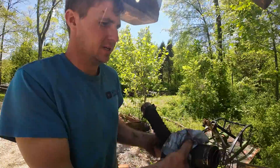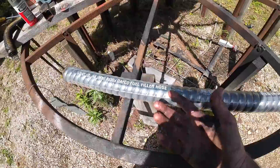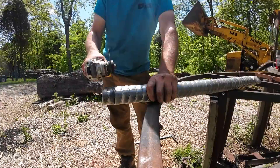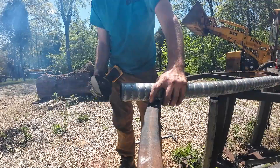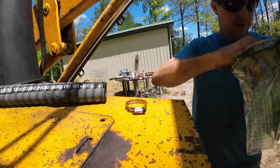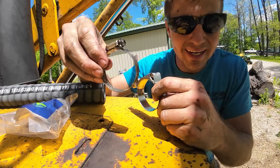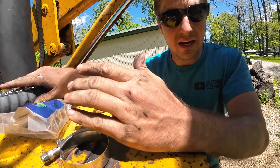These springs are on the inside of suction hoses — they keep them from collapsing. So what we ended up with is actually fuel filler hose, which will stand up to the hydraulic oil fine just like it would diesel or gasoline. It's got the spiral wire inside and the inside is smooth and is the correct diameter. For the clamps, instead of going with a regular style hose clamp, I went with T-bar style clamps — they hold a little bit more even pressure and you can tighten them down quite a bit more. These are really nice clamps. One thing I've been trying to do is as I replace things on this machine, if it stands room for an upgrade, I'm trying to upgrade it.